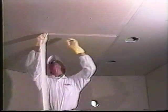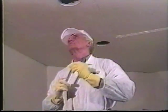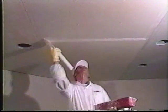Notice the simple motion needed to apply the tape to the ceiling joints. Hold one end high and stretch the tape with a slapping motion and keep moving steadily along. Of course, these joints have to be wiped before the corners can be started.